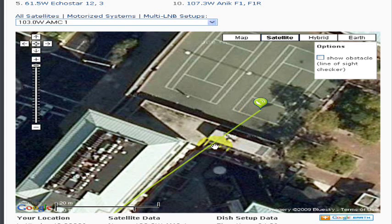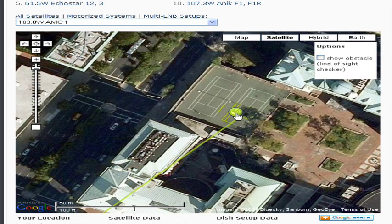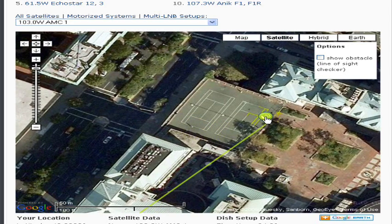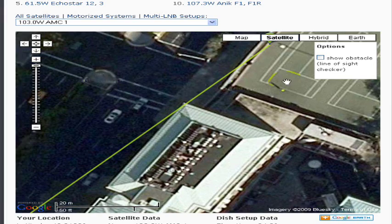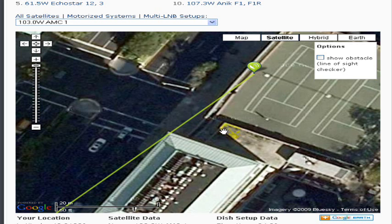We can now see the direction of the satellite drawn on the map. At this point, we have to make a few adjustments. Let's say you can see the roof of your home or building, but the green marker is not exactly in the position where you want to fix your antenna. Not a problem. All we do now is to grab the green marker, by holding the left mouse key, and drag it to the exact position of the roof where you are going to mount the antenna. You can use the zoom on the map to get closer to your roof if you are finding it hard to reposition. Now that you have found the position of your satellite antenna on the roof, observe the buildings which are crossed by the green line, because you will be using these buildings to initially point your antenna.